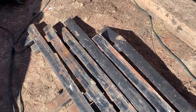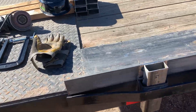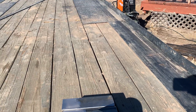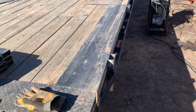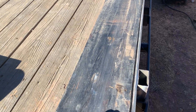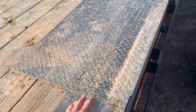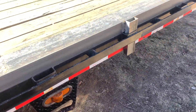Basically I'm making a solid bumper that goes down the entire length of this trailer. This is an Iron Bull 24-foot full-tilt dual hydraulic trailer. We added quarter-inch steel, 10-inch wide runners down the entire length to keep the deck in the best shape possible for loading containers.